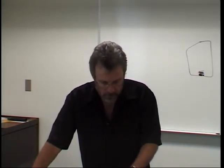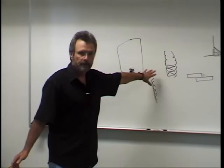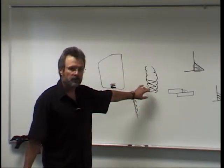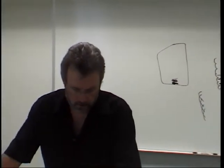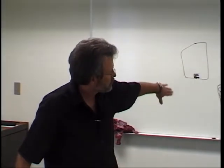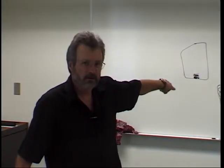A large upward movement will result in wider spaced ripples and thinner buildup — like wagon tracks, spaced too wide so it's a thinner weld. A small upward movement will produce more closely spaced ripples and a thicker buildup, so you're going to deposit more metal in a smaller space. When you're done, your weld edges ought to be straight — you should be able to just about put a ruler on it and it'll be straight.